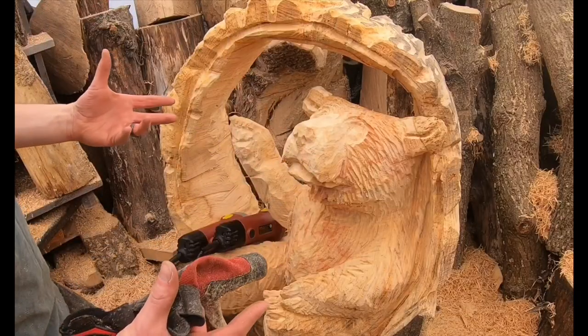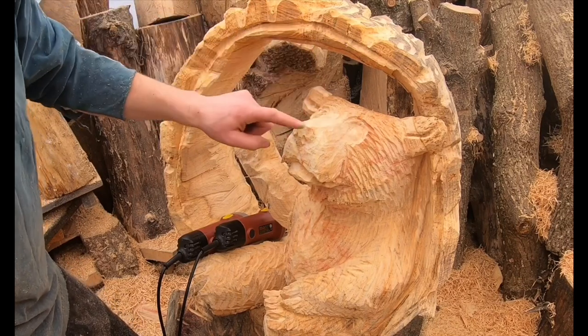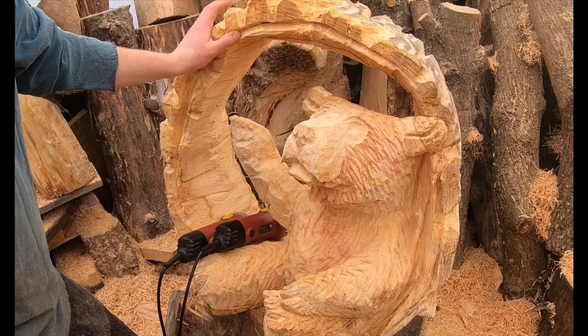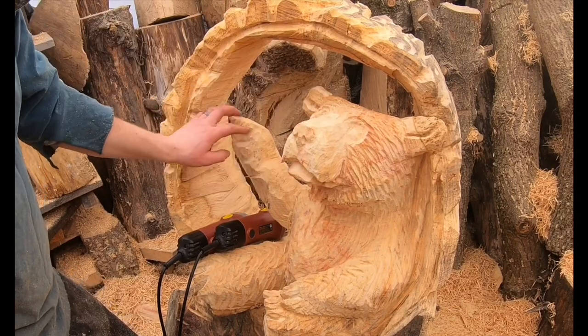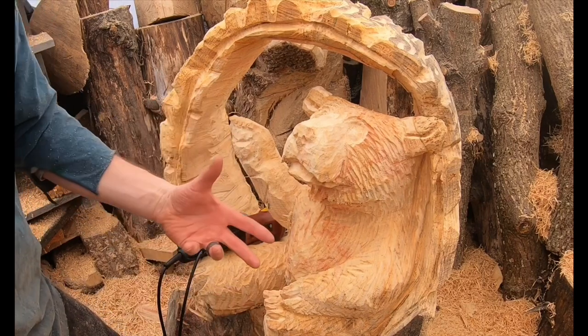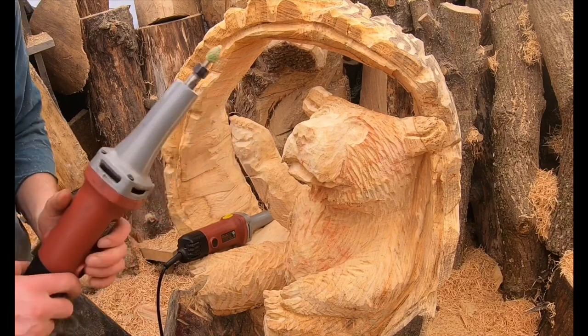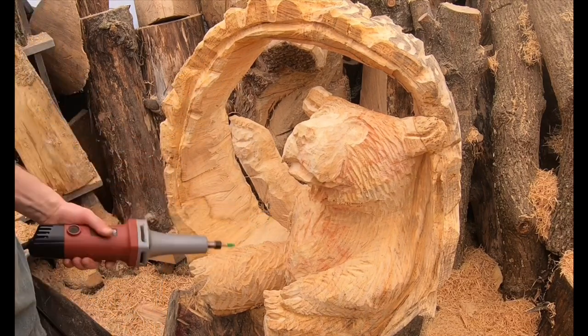As you guys just watched, I used my burr bits to clean up the bark, clean this up, and start his eyes, nose, and mouth. Now, the bark out here in the wood was done with a 3/4 inch burr bit. The eyes, nose, and mouth area, the paws, the nails, as far as they're done right now, was done with the half inch. So I took the 3/4 inch burr out, and I put the 1/4 inch in.